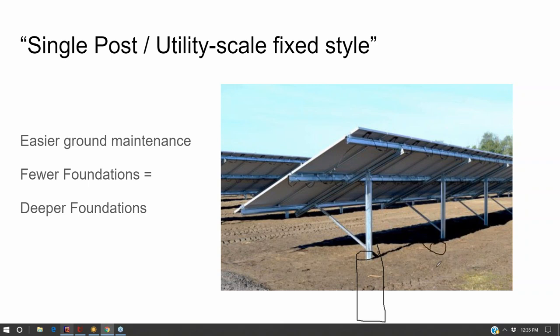If you're using a bobcat to auger out, you really could only get down about 6.5 feet. And in my experience, the engineering drawings all want you to go down about 7 feet. And you think, oh, well, that's no problem. I'll just dig out the rest with a shovel. You can't really do that with a 18-inch wide or 2 foot wide hole in the ground and a 6 foot shovel. You can't really extend yourself into the hole and dig up inch by inch. It doesn't work very well. No big deal. You put a sonotube down it and extend your concrete up out of the ground a little bit.